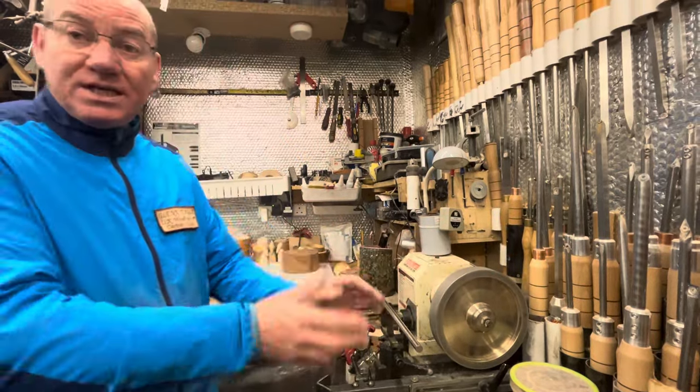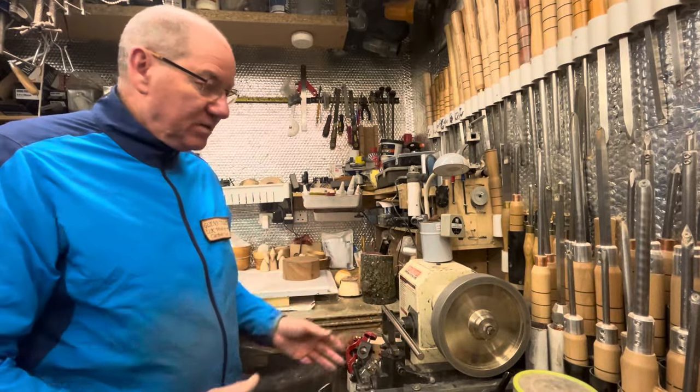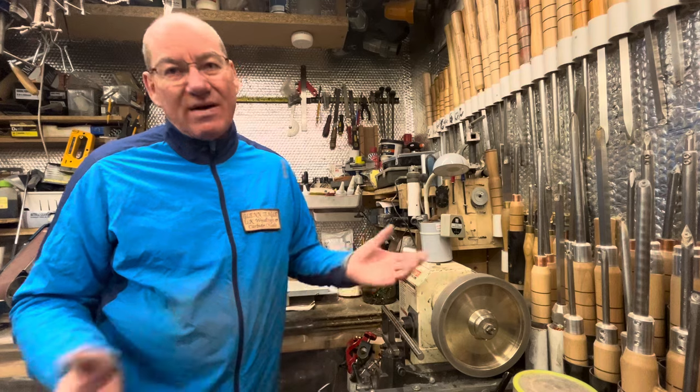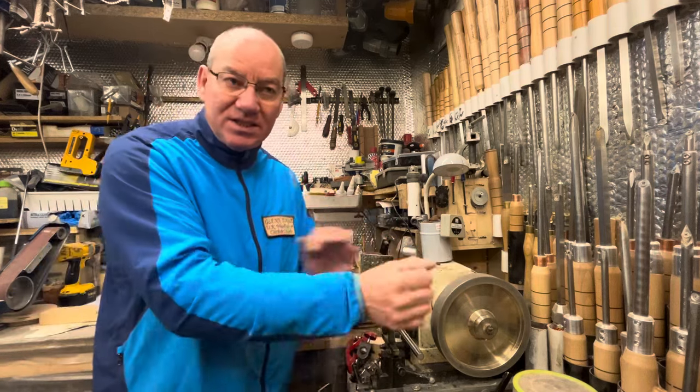And I love this. As you see, faster, slower. There's no waiting for it to wind down. People say that's slow speed grinders. Turn your grinder on, let it speed up, turn it off, and then you've got a slow speed grinder. No, you haven't. It's constantly decreasing in speed, so you're not going to get a consistent grind.